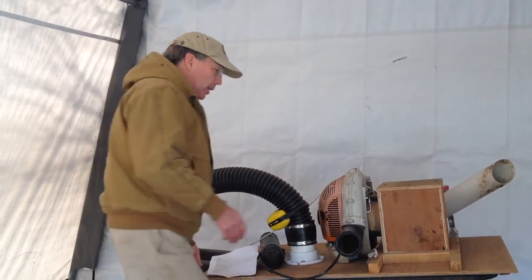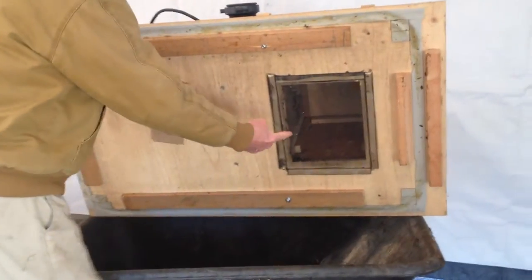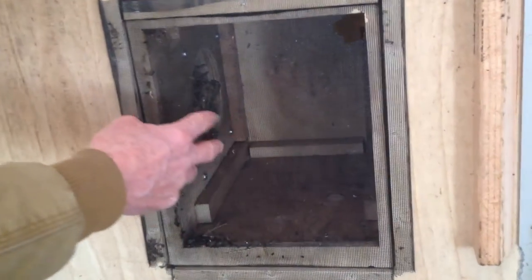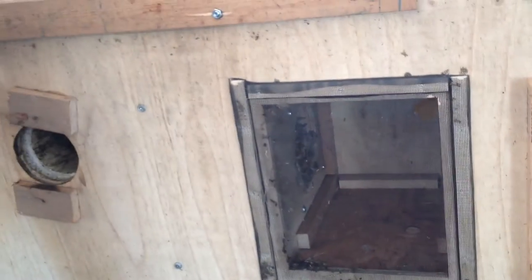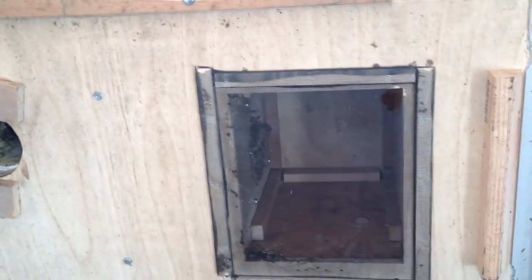Let me show you the insides of this thing. One thing I had to add was a filter. The air is getting sucked in through this piece of window screening — and the mice are already in here, I didn't notice that. This keeps the manure from coming up and getting into the impeller, so all the manure stays in here. If you have too high an air velocity, it makes everything powdered and plugs the screen up. You can see this is the inlet from the hose on top. All around the edge I used some foam sealant from the hardware store to get a nice tight air seal between the wheelbarrow and the top, because every place you leak air means you can't suck as much manure up.